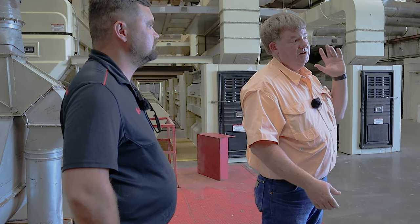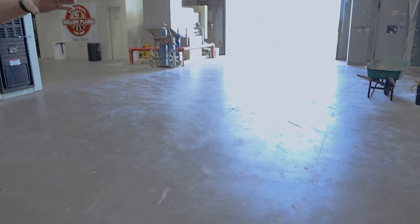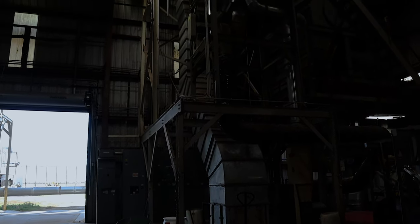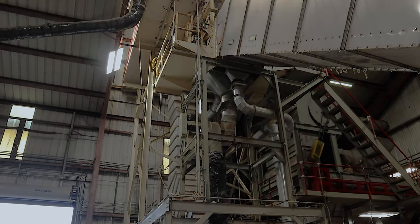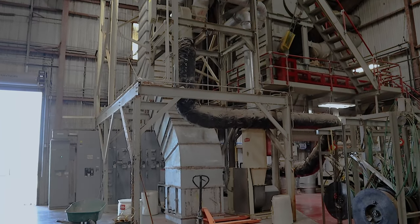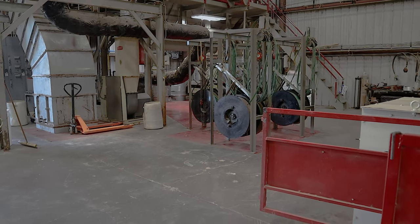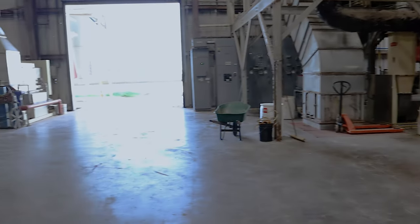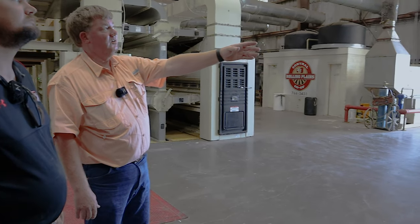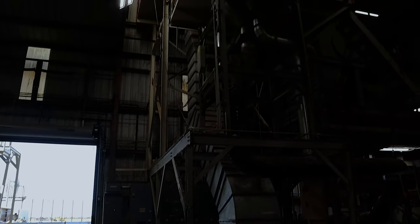So in our case, we suck our motes over here, run them through another cleaner, put them into a bale, and that bale is marketed if possible. What happens after that takes place and that cotton is clean coming off that saw, there's a brush on the back side of it wiping the lint out of the teeth of the saw, and it goes into that pipe I was talking about. The other end of that pipe down there by the number one lint cleaners comes under the floor down here, goes around and up into that square ductwork, goes up to the top to what's called a battery condenser.